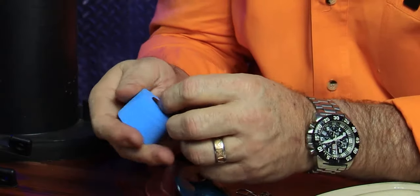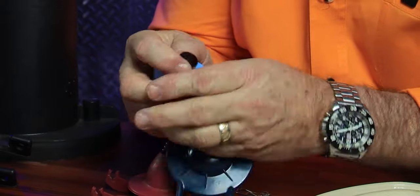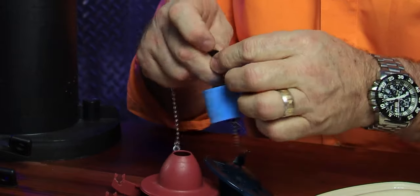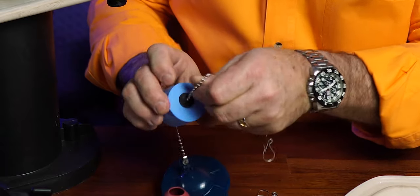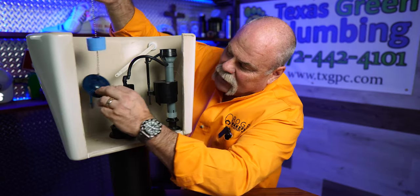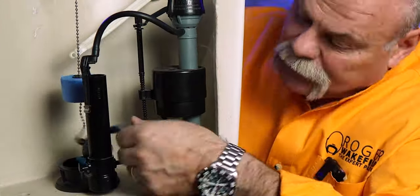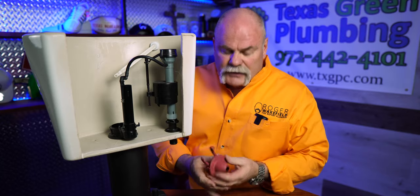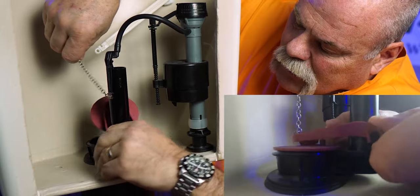To adjust the cork, slide off the little plastic piece that locks it, put it where you want it, then slide the plastic piece right back in place. Get it up where it goes, take off the one on the other end, and slide it back in place to lock it. That way when you put your flapper in you know the cork is at the right level. Make sure you don't throw the cork away — it's not going to flush right. Go ahead and put the flapper back in and lock it in place.